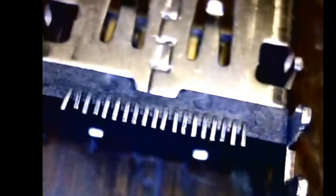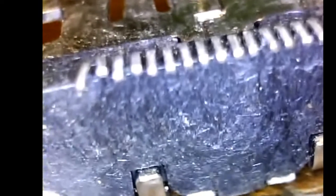They do need to be as close to straight as possible whenever you're putting these things in, so you always have to inspect. Again, 80% of them guys doing the replacements, they fail so many times because they don't know what they're doing. They watch YouTube videos. They have no schooling in electronics. They have no education in soldering. I mean, this is micro soldering. The pad that them 0.05 millimeter solder pins actually go on is only 0.1 millimeter wide.